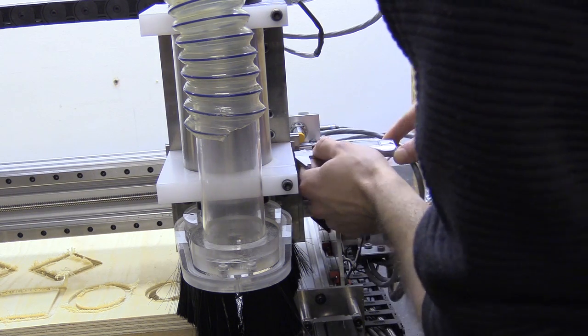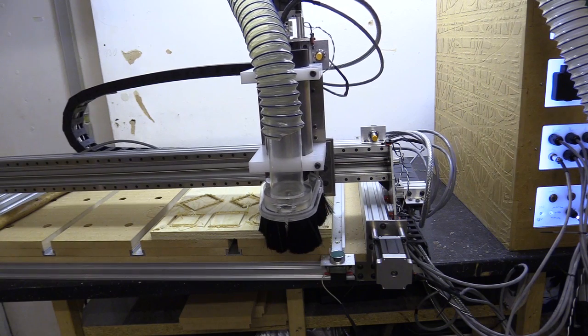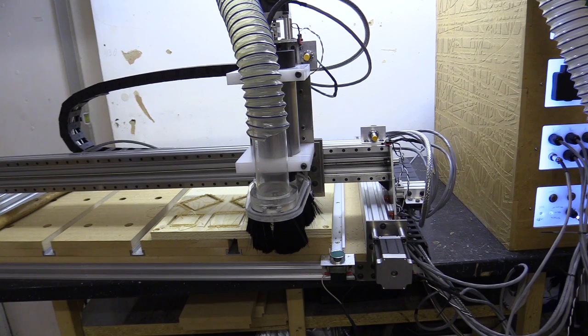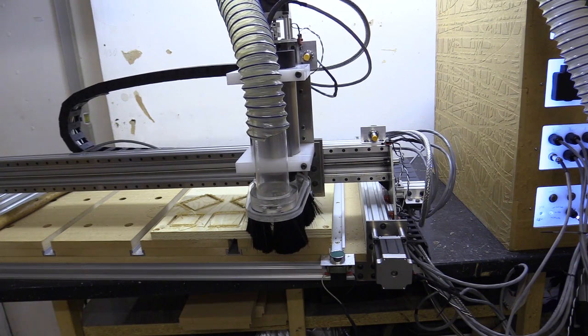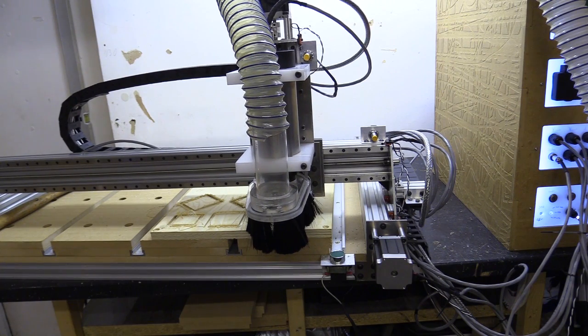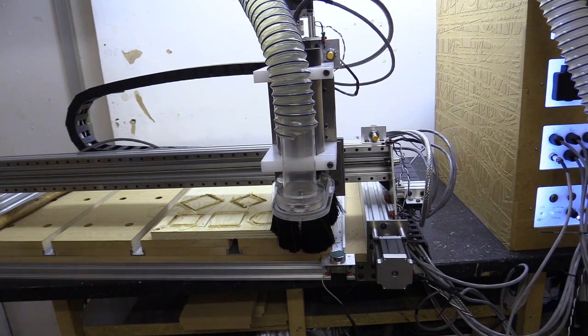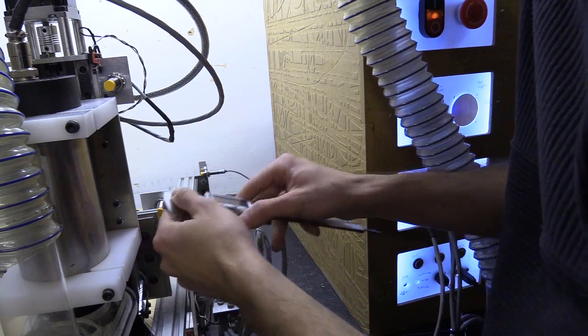Right — 28.74mm. I did a quick stress test by measuring the distance between the gantry plate and the y plate after homing, then moving the gantry repeatedly along the x axis back and forth. I then re-homed and measured again — 28.72mm. Seems fine.